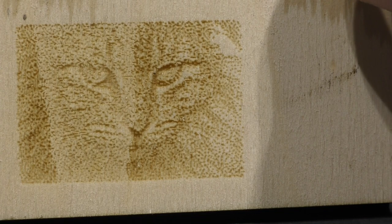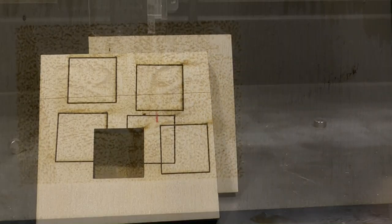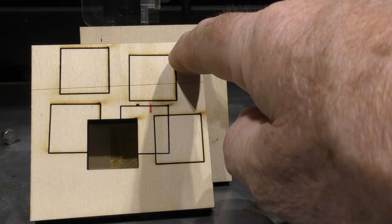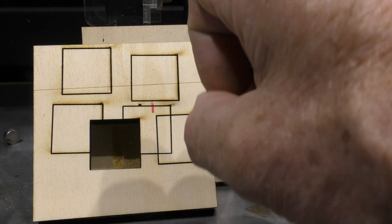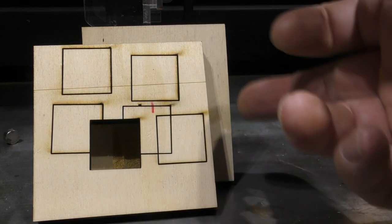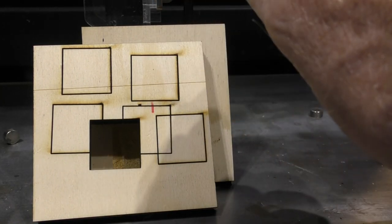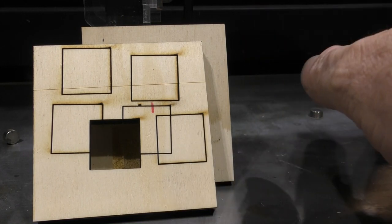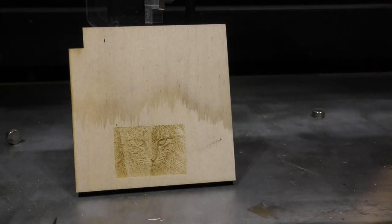It's the same black explosive uprush of fumes that occurs when you start a cut off. You will remember how we get this little explosive brown mark here at the beginning of each cut, where the laser beam has got nowhere to send its fumes except upwards. Only when we get the cut established all the way through is there somewhere for the smoke to go. And the right place for the smoke to go is out the bottom. And that is how we manage to get a nice clean cut, by pushing all the smoke downwards.